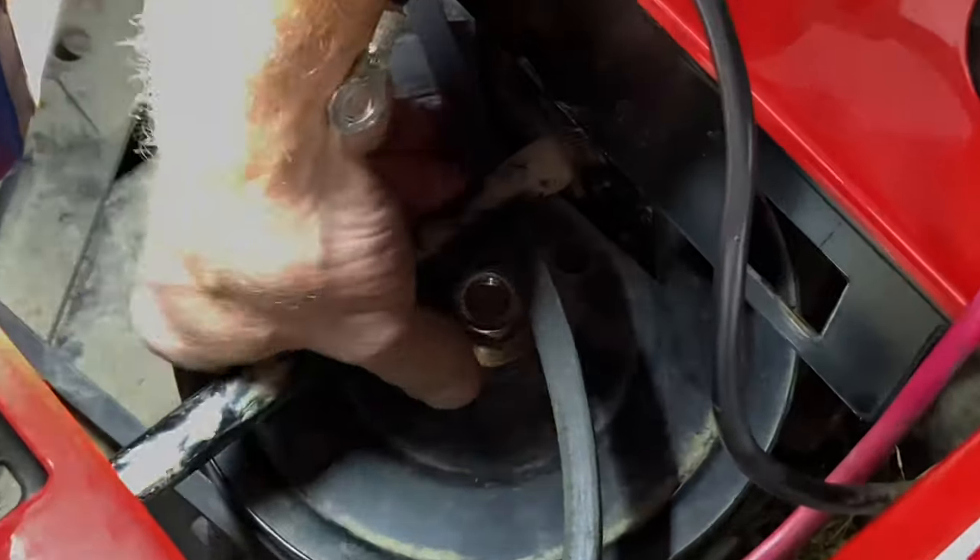Everything is now back to running as it should. I didn't replace the belt because the belt just popped off — not sure why. I'm going to take it out for a run, and if I need to replace everything, I will. I just wanted to show you guys how to put this rear drive belt on because I know a lot of you ask about this. I see a little bit of wear but there are no major cracks — the belt seems to be good. It's in gear. I'm turning it right now and it's actually moving the machine. Just make sure everything is back to where it came from. That spring is a little tricky. Make sure you're okay on this top pulley up here — it has a guide, and that guide is extremely tight to the belt, so normally the belt never pops there. Going ahead to put the battery back in — these little guys with the tabs are designed to angle and go down in there.